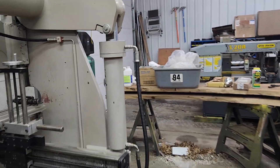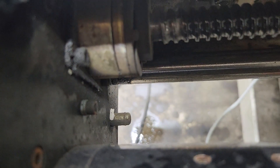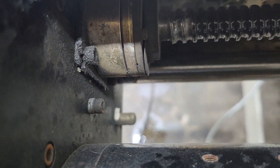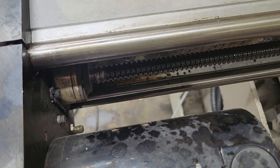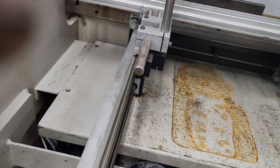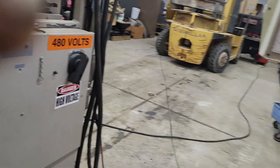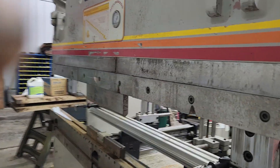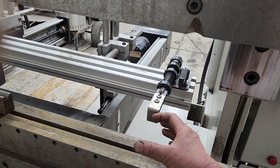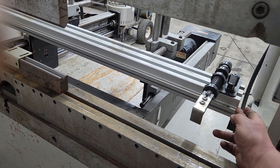I'm going to walk around and show you where that's at. We'll back up on the side that has the motor pack. If you look down right here, you will see this micro switch. When it hits that micro switch, it knows that it's 24 inches. It's going to collapse that micro switch, walk forward just a little bit very slowly until it drops the micro switch — at that point it has calibrated 24 inches. So what it does then is move forward 22 inches to the 2-inch mark. Why? Because when you get to that point, you may want to put blocks in here that are 2 inches from the center of the punch, and then you can calibrate this to match the 2 inches you're after on your control.